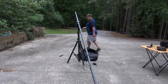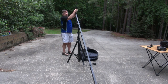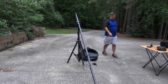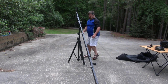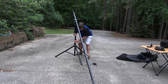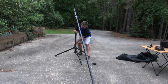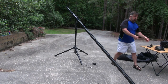We forgot a step — before putting the crane together, you want to get the base spread out. Normally I spread it out to maximum width and lock the same leg down nice and tight. Then we're ready for the counterweights.